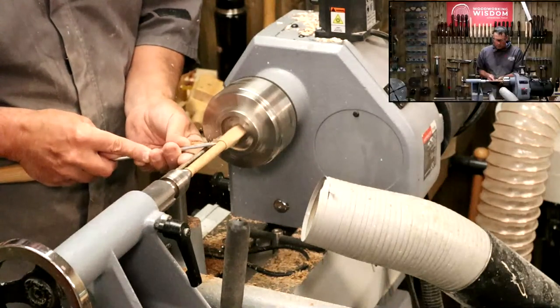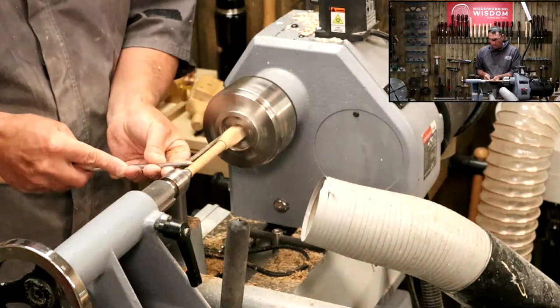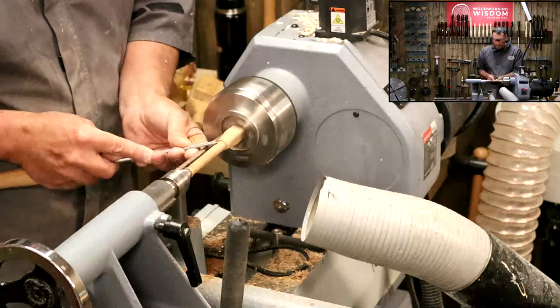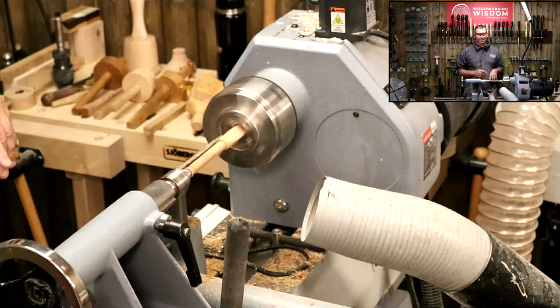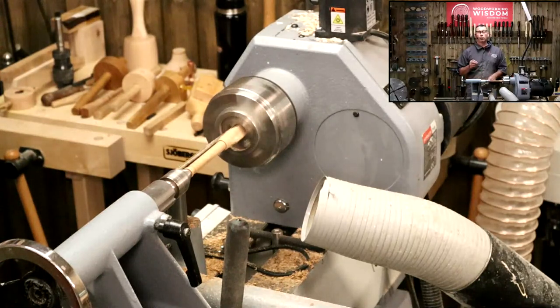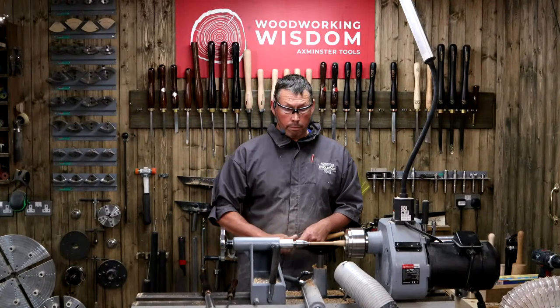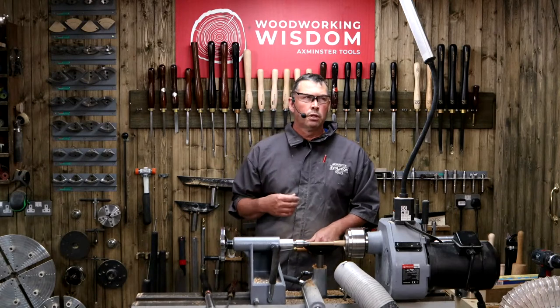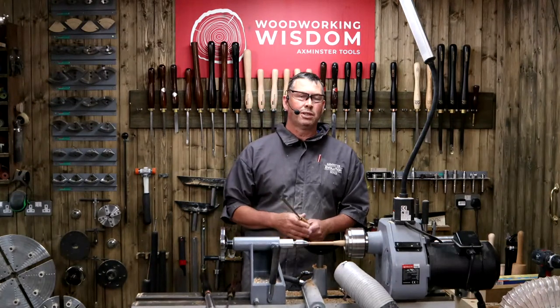That's great. So, Maria says, some people have said that soaking the threads in a bit of oil beforehand is beneficial. Is it? It doesn't make much difference on the small ones, but certainly as you get bigger, yes, it makes a massive difference. And when they say soaking, it's 24 hours, it's overnight, so it's a long time. So yeah, don't just cover it, soak it. Not so bad on dense timbers, but on the softer ones, yeah, that really helps.